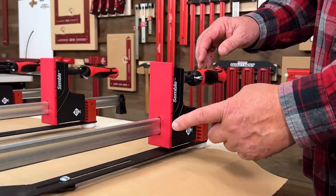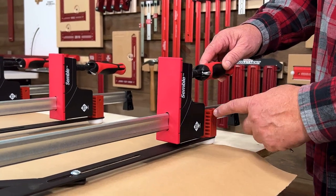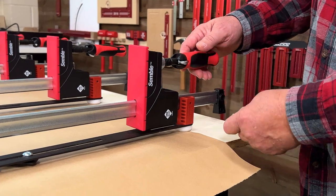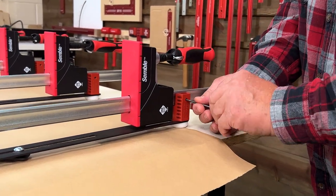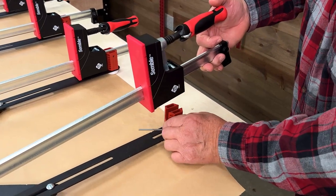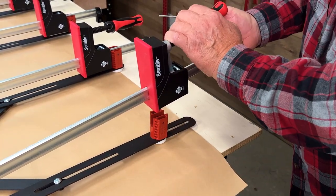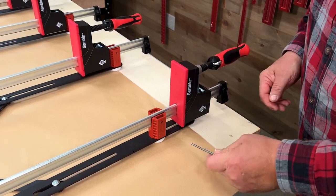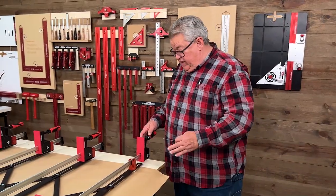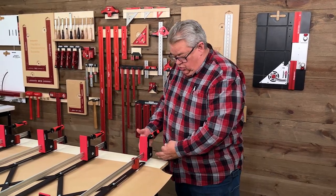Here's why. The clamping head can work either inside the mounting block or outside, and it's simply this easy to change from one to the other. Pick the clamp up, slide the mounting block forward, slide the clamping head back, drop it back in, and tighten it back down — and now you have the full clamping range all the way back to the stop.